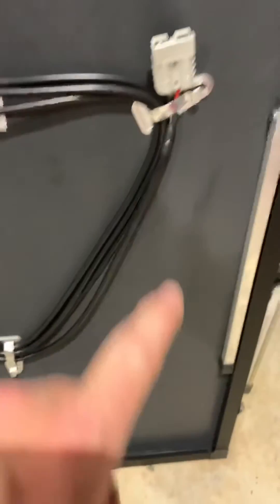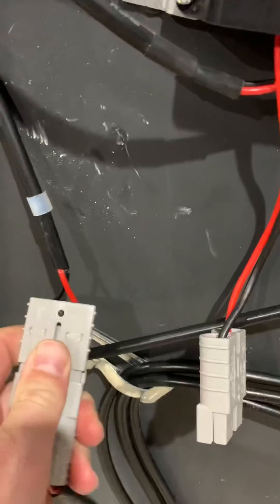Same with your long cable. Obviously this long cable is normally one cable, generally comes with every unit. All I do is cut that one and put an Anderson plug in that one. I leave those two disconnected and connect my long extension cable straight onto there.